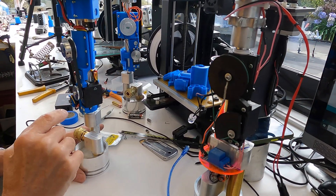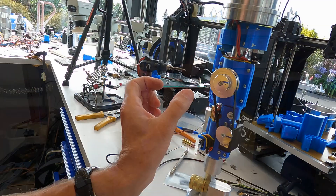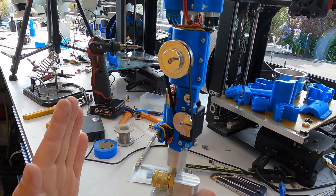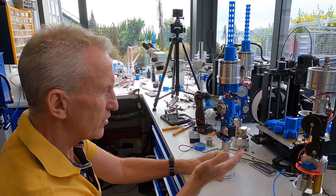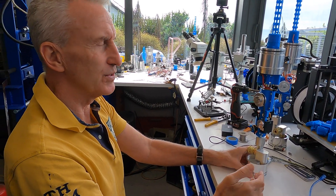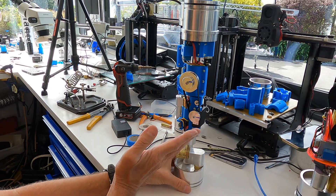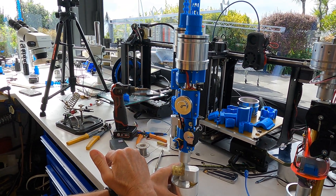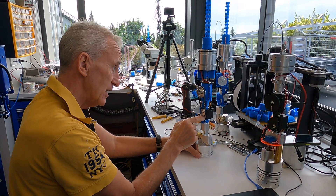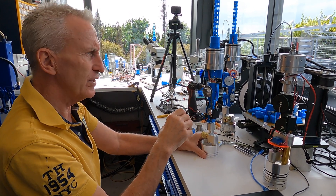The 1000 psi ball valve was deeper, so everything had to be squeezed even tighter. Because we had to go for smaller pulleys, I'm using the full sweep of a servo — actually just under 180 degrees, because it's well known that servos don't actually go to 180 degrees; they sometimes go to 178 or 175 even. So I've had to build that into the ratio between this pulley and that pulley. I haven't done the full open yet — I'm still using this program, so this is merely to see whether the servos with this pulley system will actually work.